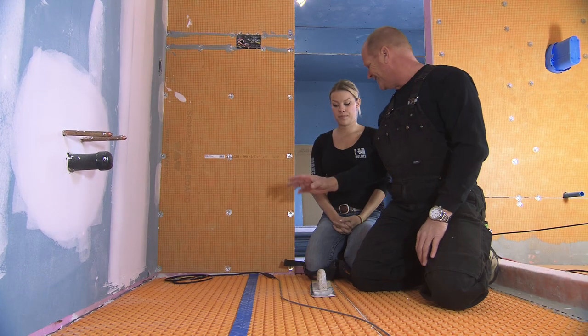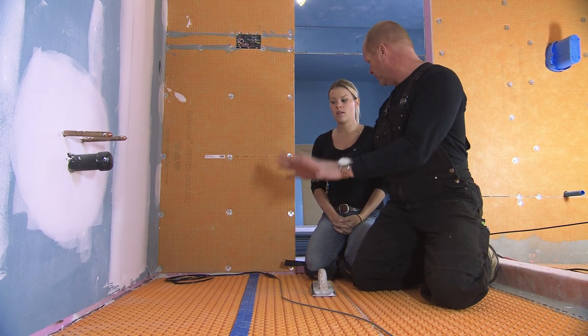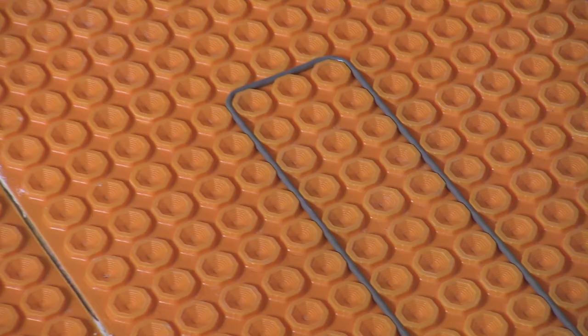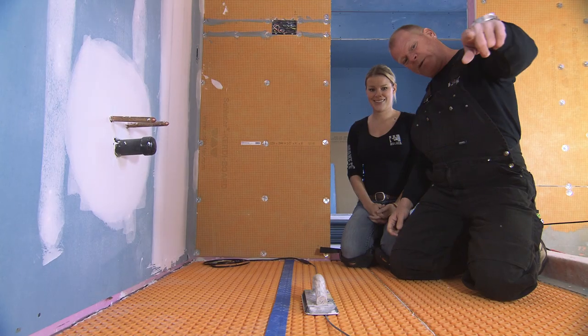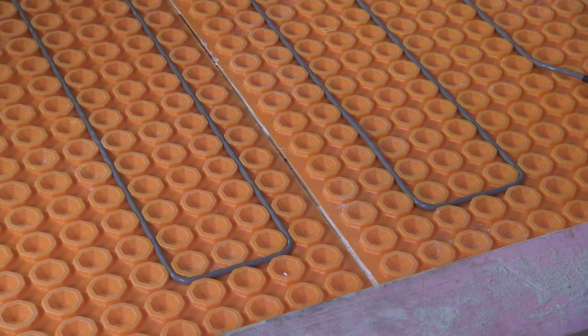Do's and don'ts: we're gonna be at least three full pucks away from anything. We don't need to put the cable under the vanity or under the toilet. Keep it eight inches away from any heat source — a hot water pipe, a register in the floor — eight inches away. Loop it at three inches, three pucks, all the way through. Nice and simple.